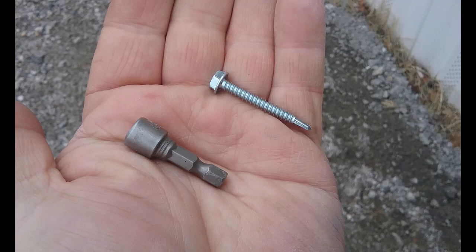Get several nut drivers because you'll probably lose or misplace them, or your helper might go home mad or something like that. I think we could have gotten by with inch-and-a-quarter screws, but I just felt better going with inch-and-a-half, since the old ones were probably an inch long and I wanted something really meaty into the studs. We went through about 500 screws on this install — there were 13 or 15 windows, and the big windows took like 36 to 46 screws each.